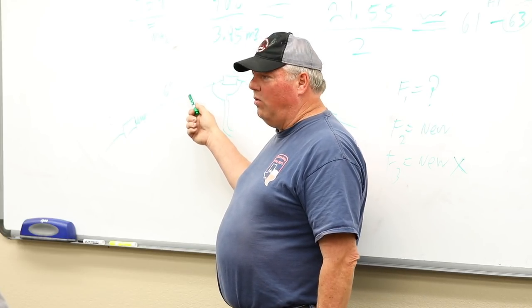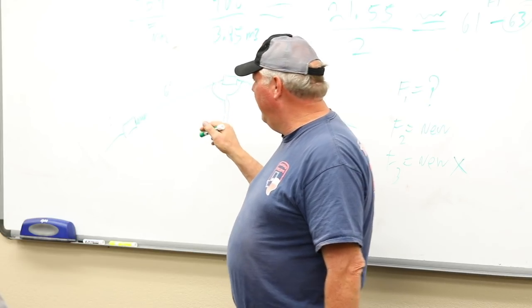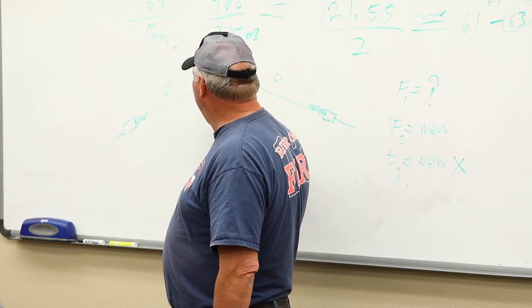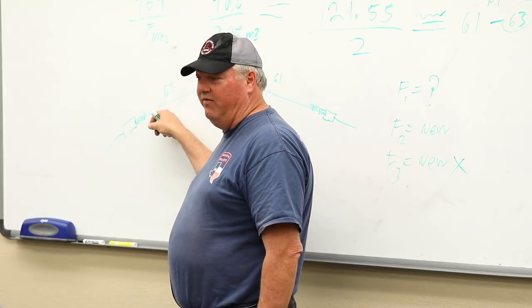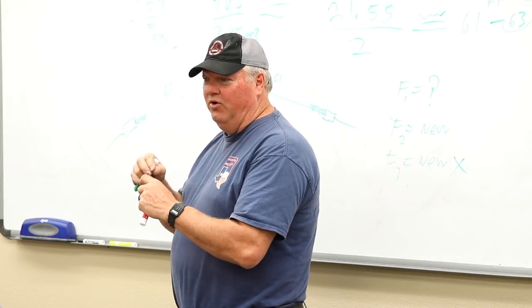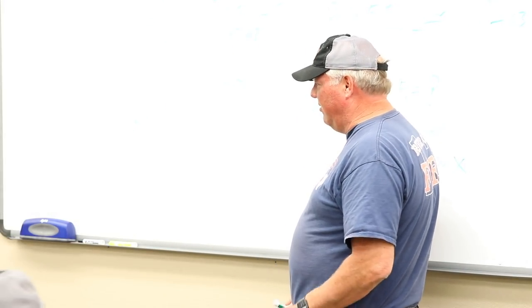Better quality, thicker wire will give you a little bit better bandwidth. I'm not going to go into all that tonight, but you've got these guys that build these. The feed point's here, and there'll be a little bar here, and you'll see two wires that are exactly the same length, right on the side of it. It didn't make it any longer, but it made it thicker, and it helps with the bandwidth. Birdcage. That's a version of it, but we're not going down that road tonight.